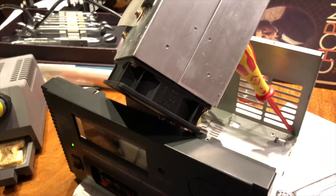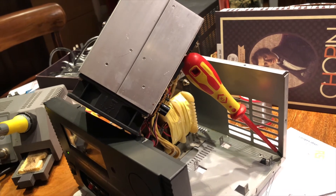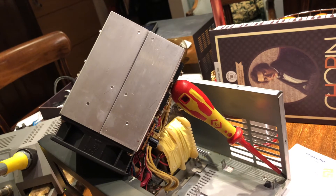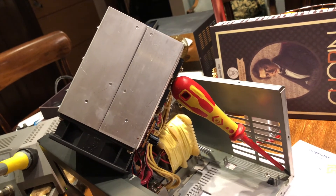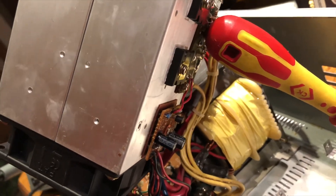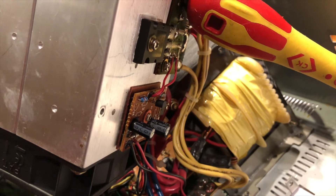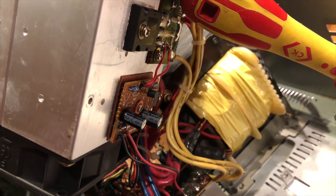Quite pleased about that. If you have one of these power supplies, the components in them are exceptionally high quality — it's a nightmare to take apart and get to the fan control board. My first part of the test was to put a 4.7k resistor across the thermistor contacts and the fan ran. Then I tried a 10k and it ran slower. So the Darlington-type arrangement on the fan was perfectly okay. A couple of probes across the thermistor now indicate 8k — they were indicating 100k before, and 30k the other way because of the bipolar junction on the transistor.